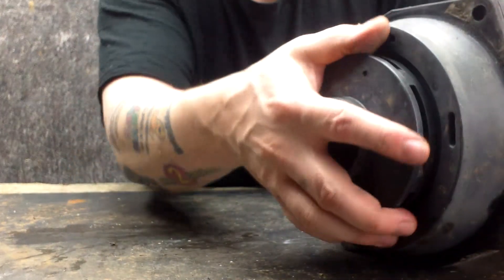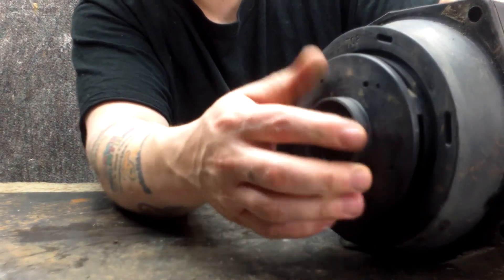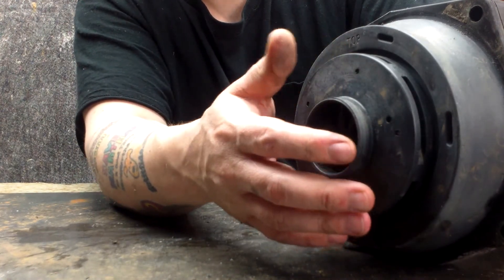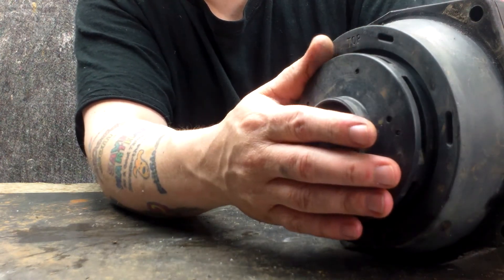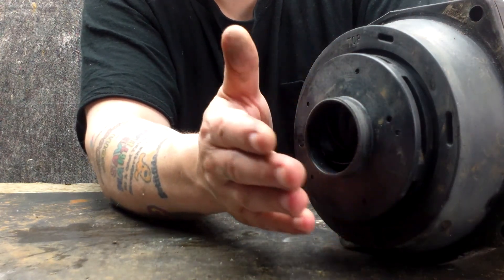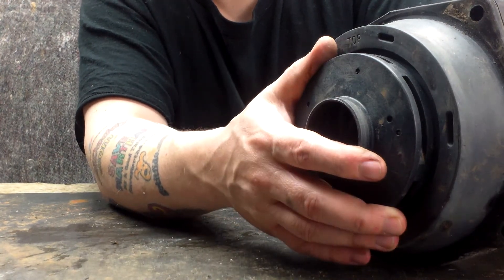Now what we have there is the impeller. This impeller is actually going to spin, but this motor is frozen. So we're going to loosen that — usually the motor spins, so if you have a motor that was just making noise and your shaft still spins, we're going to show you how to loosen it by taking off the back cover. I'm going to show you now how to remove the impeller and the seal plate, how to remove the seal from the seal plate, and we're also going to show you how to take apart the motor.